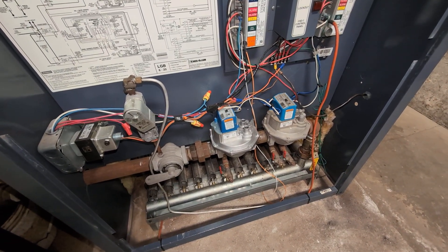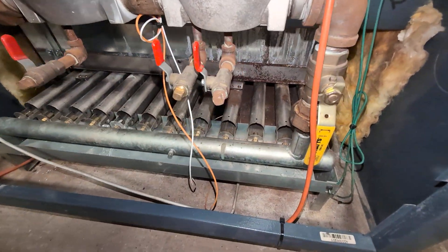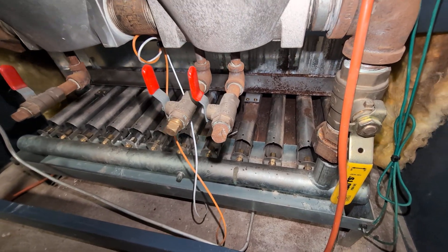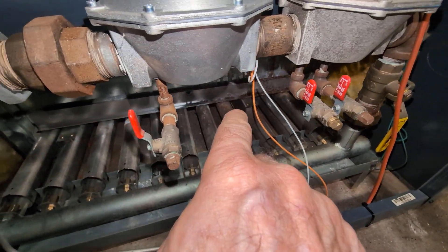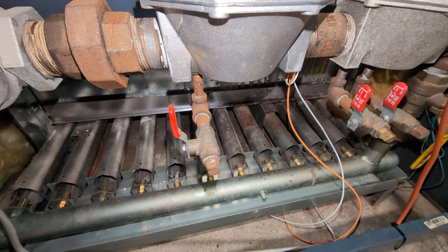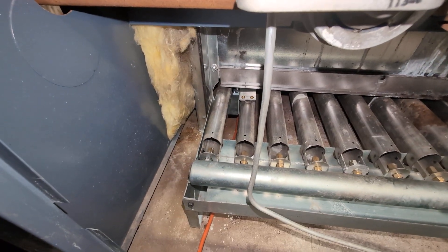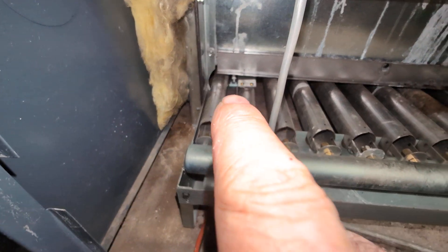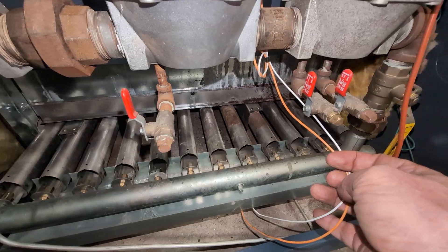What was happening in this particular case is that the leaking sections over time impinged on the reliability of the ignition sequence. Right there — that's a new bracket where my finger is, that I installed just today. I used brass screws. There's another bracket there — that's the flame sense rod — and I used brass screws and anti-seize to put it on. You can see the flame sense rod there, and this is where the pilot assembly sense and spark are.